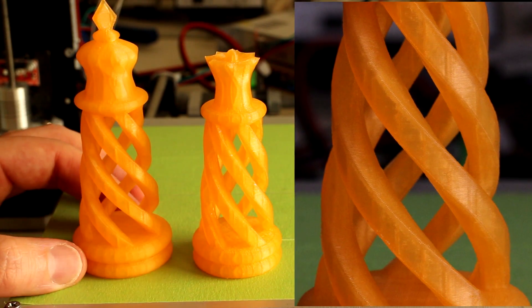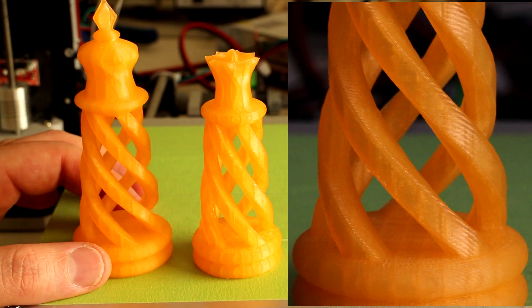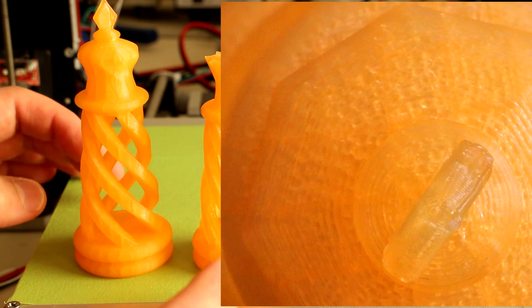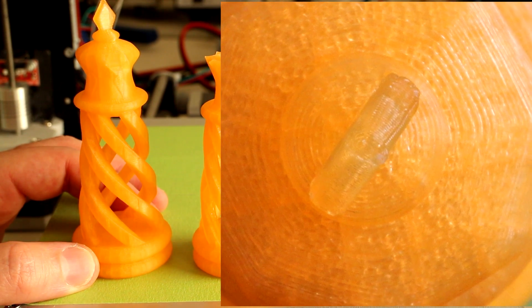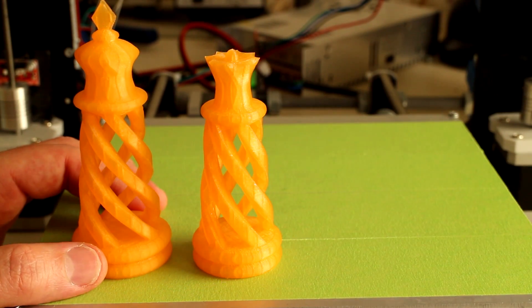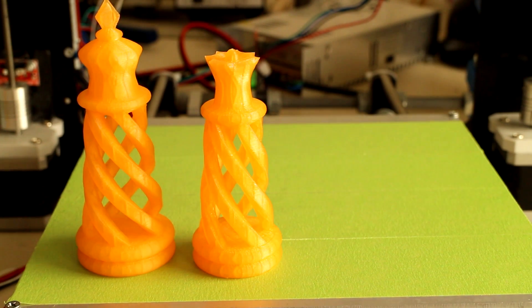It has that same dithering effect when looking through it, like a glass sculpture. You would have noticed it was printing quite slowly. I used quite aggressive cooling and a high minimum layer time, because I wanted these spirals to come out nice, uniform, and sharp — which they have, as there is quite a bit of overhang. These parts look absolutely beautiful.